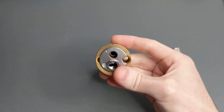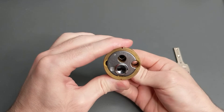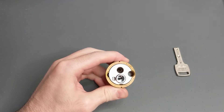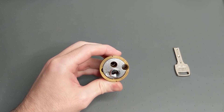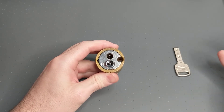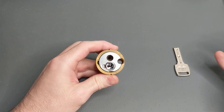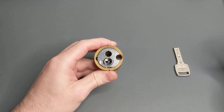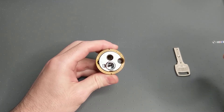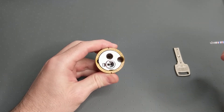These were developed back in the late 1960s, taking advantage of the relatively new Samarium Cobalt magnets. But as they are purely magnetic locks, they have binary tumblers — you can only have two orientations for each chamber, either north pole in or north pole out, and unfortunately that makes them relatively easy to decode.